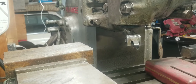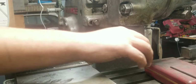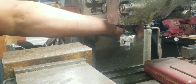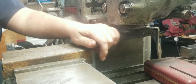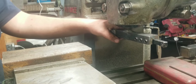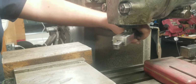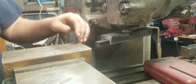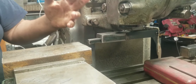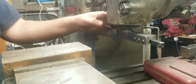So here's what that fly cutter looks like with a tool in it. I finally freed those tools from my old fly cutters. I took them out, I ground out the welds, took them out of the holder. Finally, you know, took out the temporary welds. We're holding them in there. Now I'm going to take a skim cut on this chunk of forklift tine. That's just to see how it does, just to see how well this tool does.